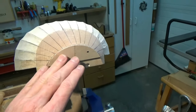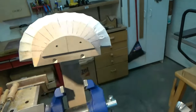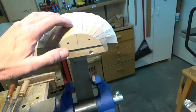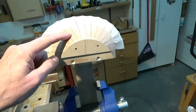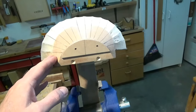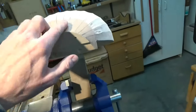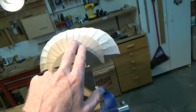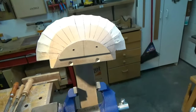This template can be retained for later use when another lute is built on the same mold - it's just a simple matter of marking the ribs and the block. I don't usually bother planing this flat when the rib is joined. Just before the rib is joined to the previous rib, I start in the center and build outwards in both directions, alternating. Then you just take a chisel and flatten it. It's very simple that way and you can actually manipulate the two levels of the two ribs joining together very easily at the point when you're going to join it. Don't try to manipulate that too early in the process - it's just too early.